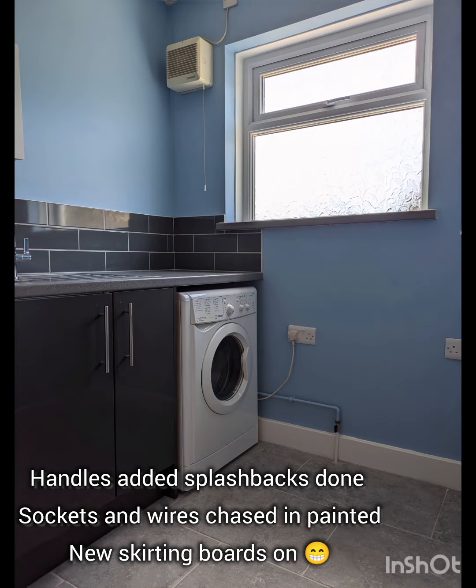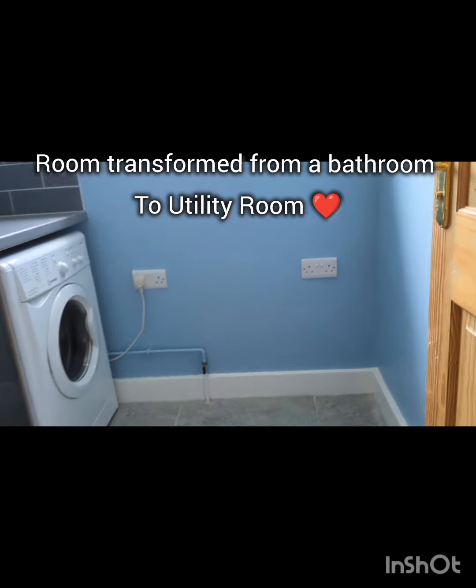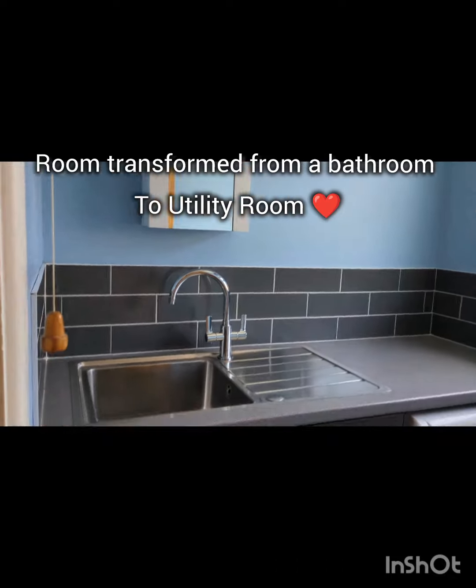In my own personal pride, there was no way I was going to leave wires tagged onto walls and back boxes. So we went back in, chased in some proper boxes, put the sockets up. Whilst we were there, he's probably going to put a washer dryer in, so we put another socket further along — all at knee height, so there's very little bending.